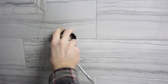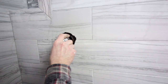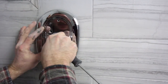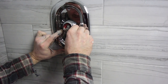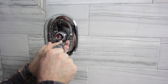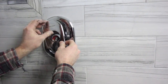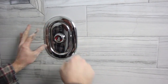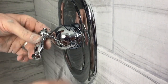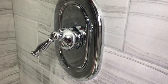When you're tiling your shower, leave enough room around the shower valve to access the shutoffs — that's really important. We placed a chrome fitting over top of the cartridge, then the escutcheon. The escutcheon is held in place using two screws; position them through the escutcheon and into the shower valve itself and tighten them down by hand, not with an impact driver — that's super important. Then there's a little cover that goes over top to cover the screws. You'll need a little Allen wrench to tighten down the handle. The handle is really cool: you just pull up to turn the water on, then adjust the temperature left to right.